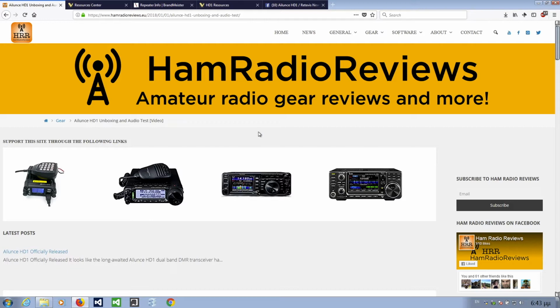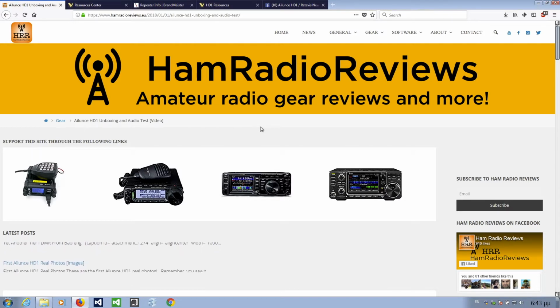In this video I will show you three things. First thing is to upgrade your firmware, how to upgrade the firmware of the radio. Then I will show you how to load an address book into the radio so that it shows you on screen the call sign and the name of the person you're in QSO with. And last but not least, I will show you how to program a DMR repeater into the radio with the programming software.